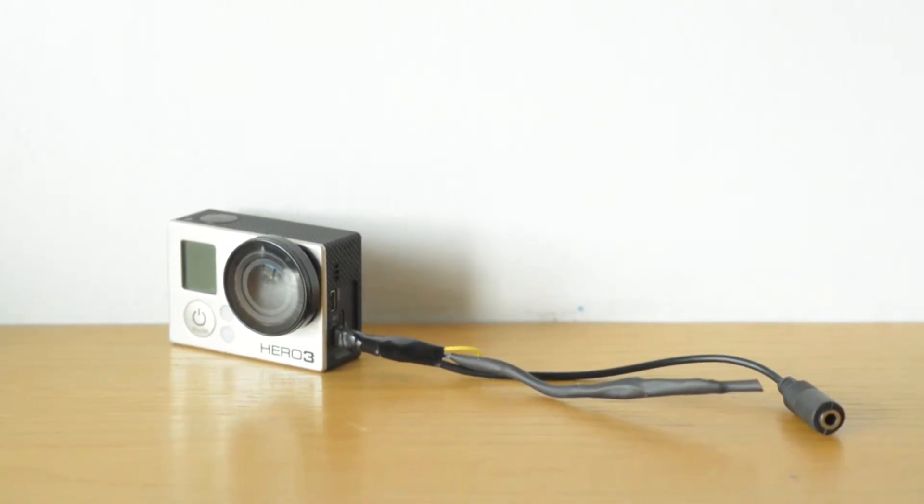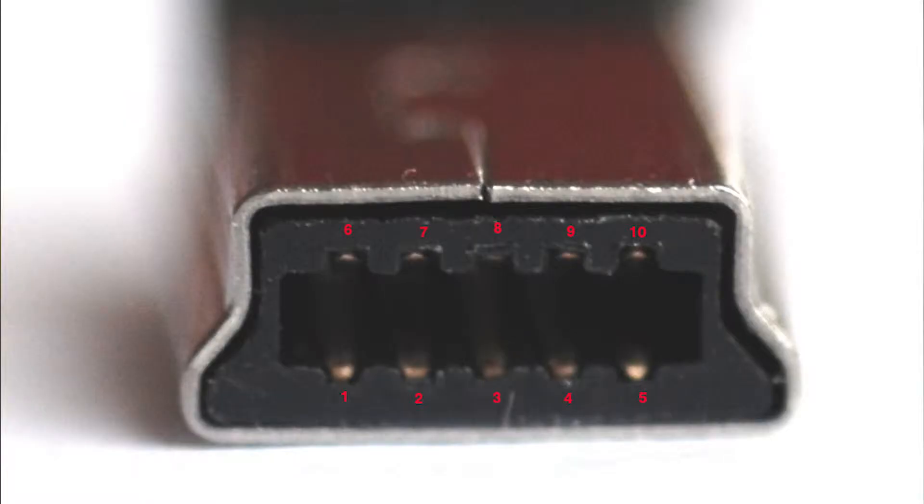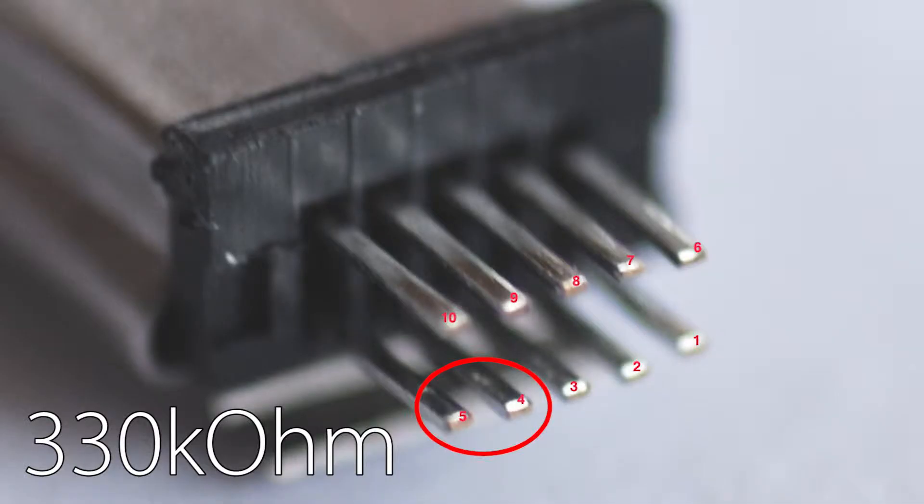I decided I will check out what is wrong with it. I opened the mini USB part of the adapter and did some research on the internet. I found that you must short out two pins with a certain resistor to enable the top row of pins. For the microphone functionality you actually have to connect a 330 kilo ohm resistor to the two pins I will show in the picture.